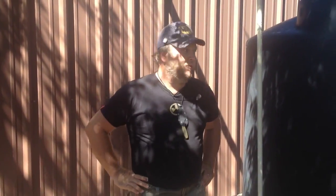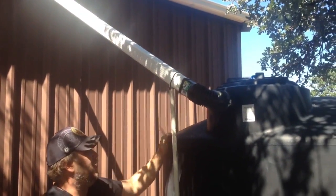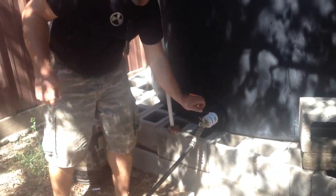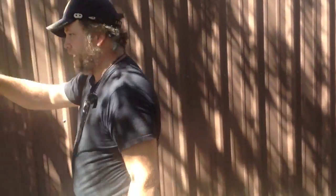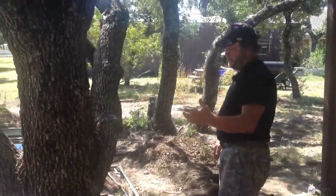Just to give you a better look at what we've done: you can see we have the gutter — it's a 30-foot long gutter plumbed into the tank. There's actually a baffle valve that allows the tank to overflow should we get 1,550 gallons or more of water in there. We've got a three-quarter inch hose bib fitting down here, the hose run down to the lower tank, two feet of rise that this thing's sitting on, plus a little slope and the tank in the ground.